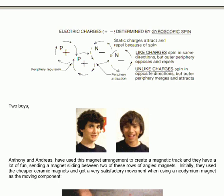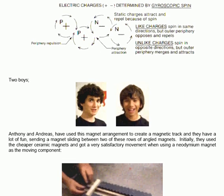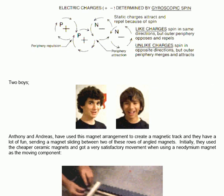If you have opposing fields, north to north repulsing each other, then it is liable to detract from the power of the magnet eventually. Some people have produced motors and discovered that after 3 months of running they stopped operating altogether. It's not a major problem, because you can reinstate a magnet in a split second by putting it inside a coil of wire and pulsing that coil of wire with a high current. It only takes one pulse to regenerate the magnet. And you can use fancy things like neodymium magnet material to get a powerful magnet, or you can use ordinary mild steel, and that will certainly give you quite a good permanent magnet.